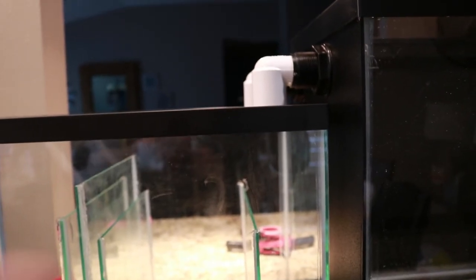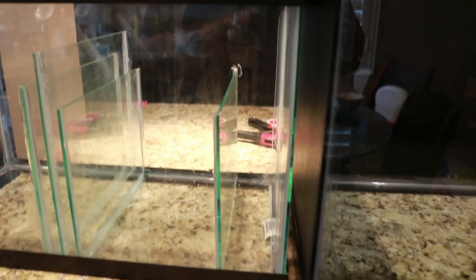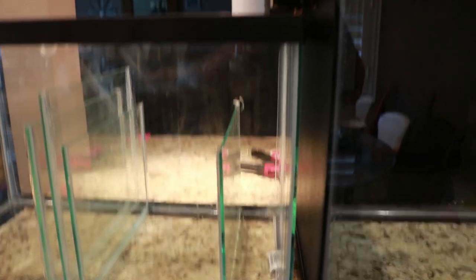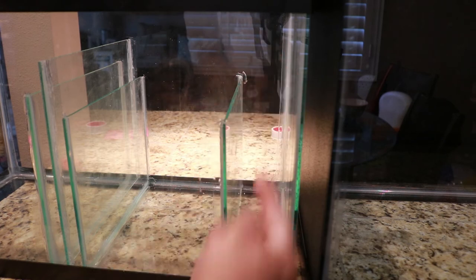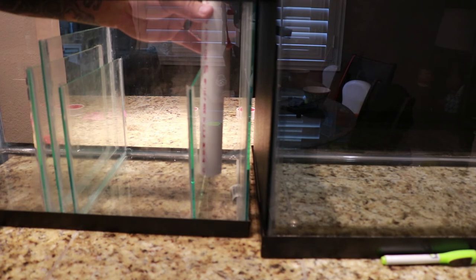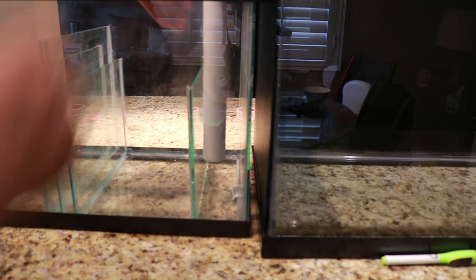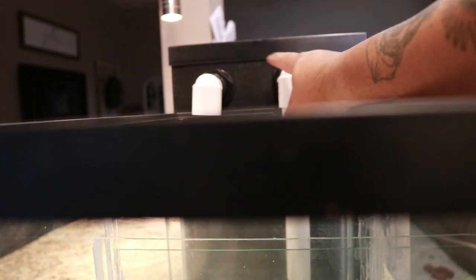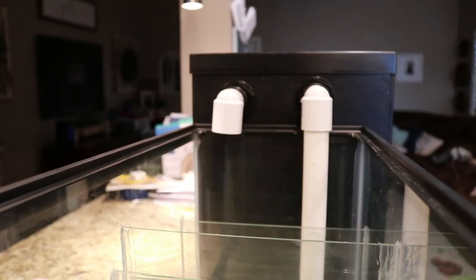I have the drain with the 90s on. I'm going to cut a piece of PVC so it drains down onto this side. I measured it — I want roughly a 10-inch pipe ending up about here. These aren't going to get glued in, just fit in, in case I need to pull them out to clean. You can see this one is just a bit higher so if one gets plugged I still have a backup. Then I'll fit both of these into the bottom of the stand.